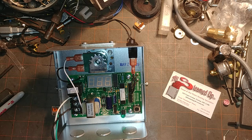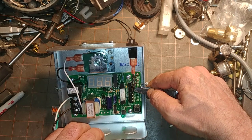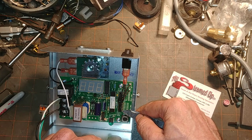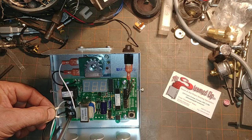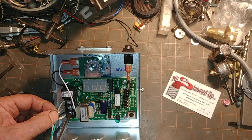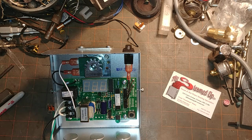We're going to do a quick operational test. It's set to go with the low water cutoff at a two-minute delay. What we can do is set it to a 32-second delay — which is not recommended — and we'll go to a one-gallon feed, or one-minute holding open of the solenoid. This is line voltage, so be extra careful. We'll slip one end of this jumper wire underneath the hot and send it to the feed trigger, which will send a signal through the circuitry. We'll know that's the case when we see a period after the zero when we turn this on.